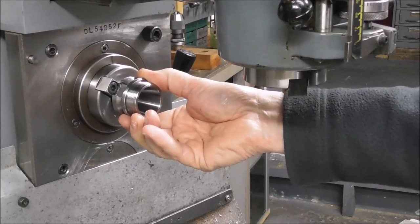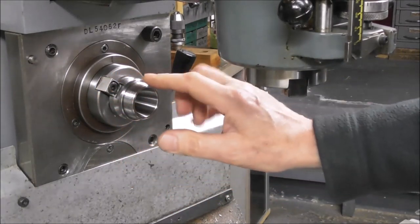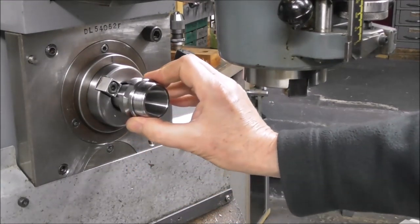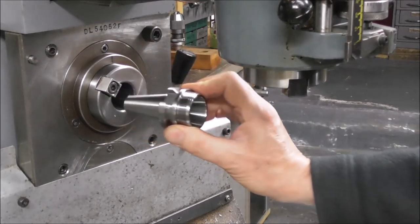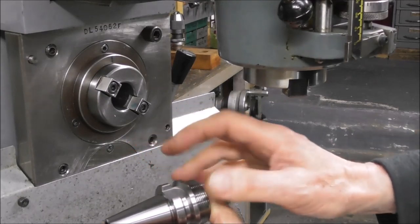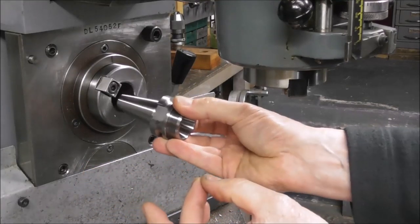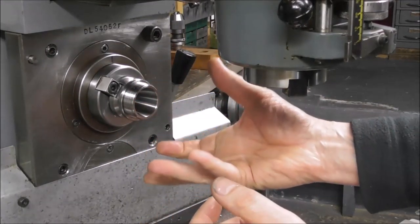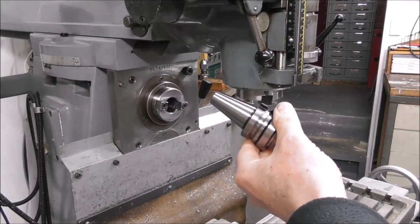These drive dogs are never going to be perfectly in position, and the slots are never going to be perfectly in position, so it's always going to be biasing the holder off. You must have clearance there. If you buy a low-cost holder like this, you'll have to set it up in the mill with a carbide end mill and machine a little bit of clearance — either in the cross-flats dimension or across the width of the drive dog slot — because there must be clearance there, otherwise it'll interfere with the concentricity of the holder. Then there's the BT30 taper itself — let's have a look at that.